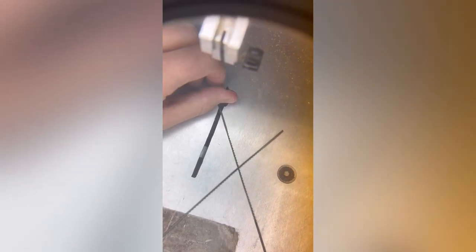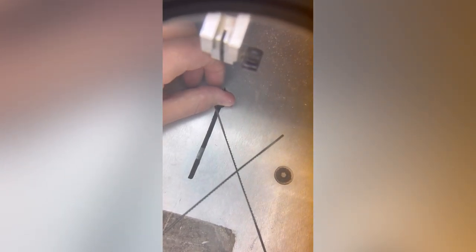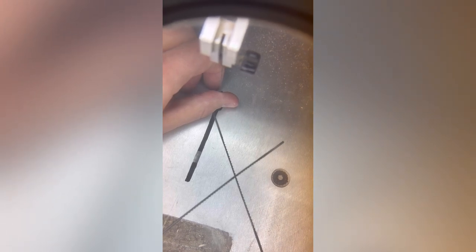Does that mean that this blade is dull? No, it's really not — I've only used it on a couple cuts and just recently switched it. It just means that the blade's not moving fast enough, and these individual teeth are catching my skin and throwing it down, causing it to basically just run right over my finger. I put it on my thumb for a good while and I don't have a mark to show for it. That just shows that the scroll saw can be a really safe machine for a younger kid, adult, or older person that wants to get into woodworking.